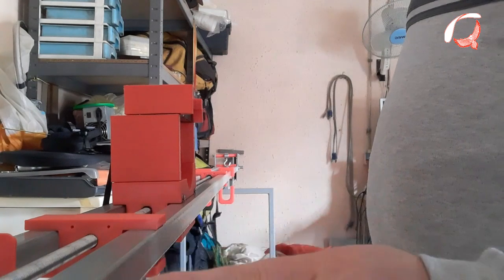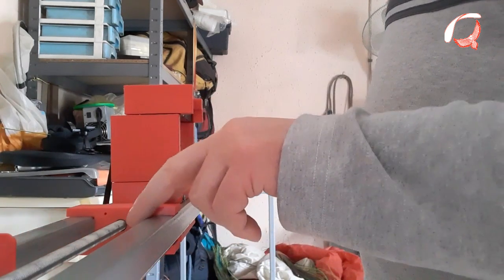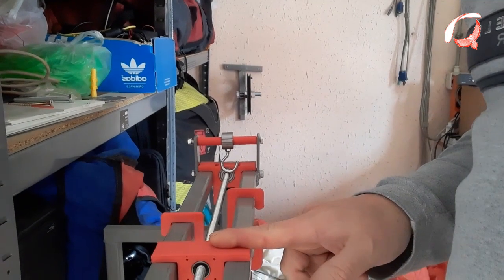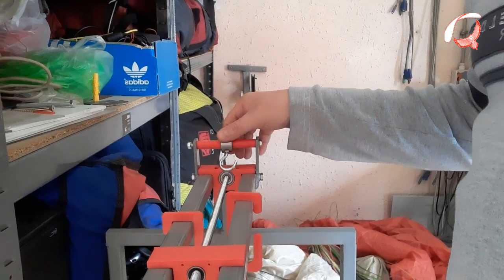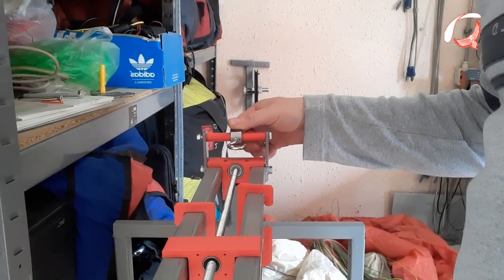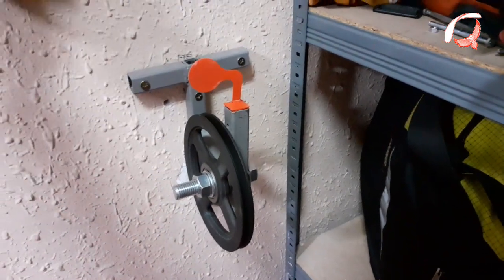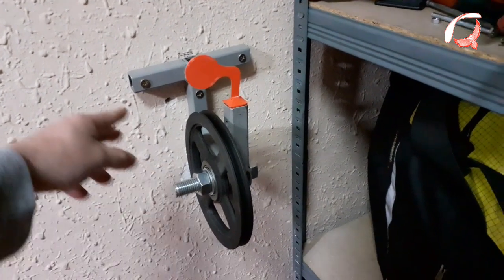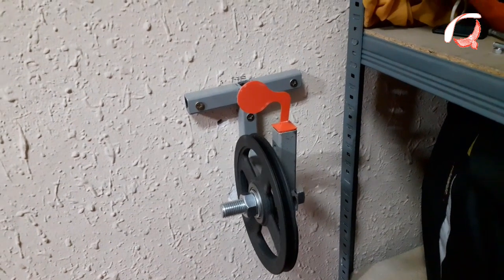The rail frame has the following components: railway, leading screw, instrument car, leading screw holder, riser holder. On the second side there is also one leading screw holder, line holders, and an attachment point for measuring separated lines on the paraglider. The last part of the machine is the middle holder, which is on the opposite wall from the main frame and has a wall holder, one wheel, and a laser meter reflection point.